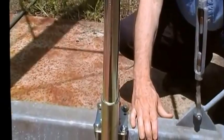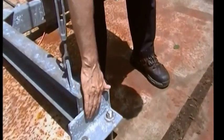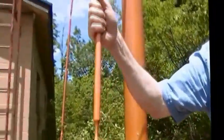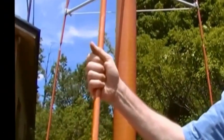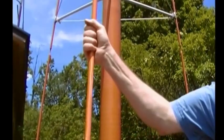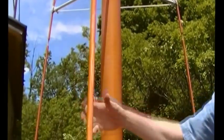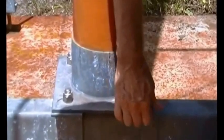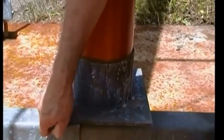The next thing we want to check is the mast itself. We want to make sure that our hinge points are properly engaged — there are no gaps between the angles and the end of the channel. We want this pin fully engaged in this angle on both sides. Then we want to check the stabilizer rods to make sure that they are not loose; they should be snug and not rattle when you shake them. Finally, check the attachment of the stand plate to the tube on the base to make sure that's proper and the parts aren't loose or coming apart.